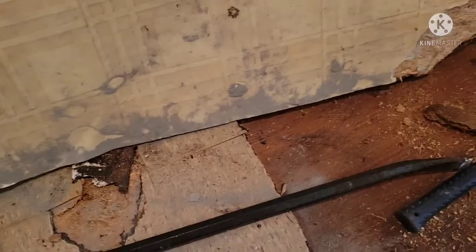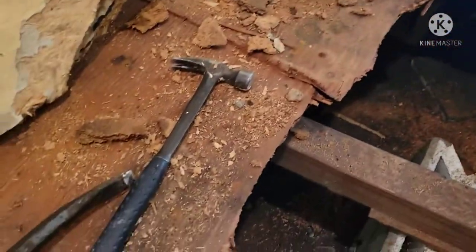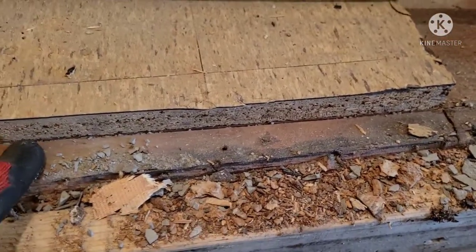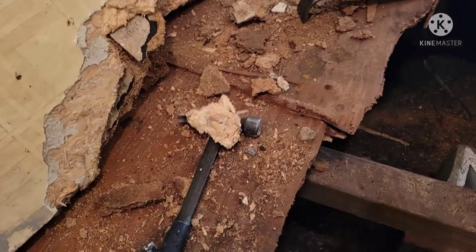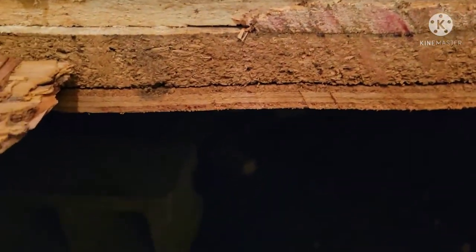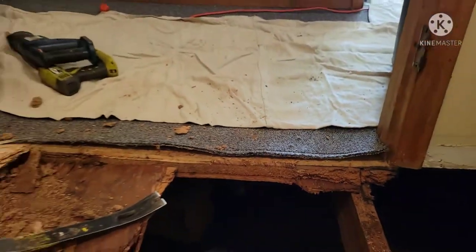Here's where I'm at - I got it all ripped out to the floor joists. Here are the pieces - most of it. A piece of half-inch plywood, quarter-inch, three-quarter-inch wafer board - this is one of the original floors. Here's another floor - three-quarter or seven-sixteenths OSB. This one had three layers: half-inch, three-quarter, and seven-sixteenths. So basically half, half, half, and then on top of that it had quarter-inch underlayment for the linoleum floor.